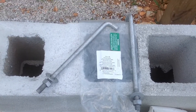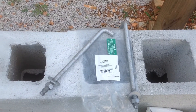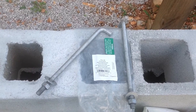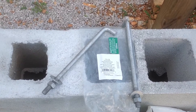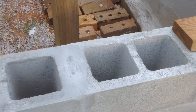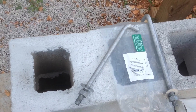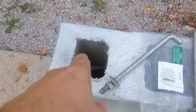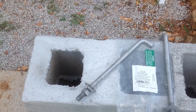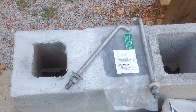We're going to show you how to install anchor bolts. An anchor bolt is what holds the house — the wooden structure — to the concrete foundation. They can be put inside concrete walls or inside concrete blocks, which is what we're doing here. The center of the hole is hollowed out, so we'll be putting concrete inside and placing the anchor bolt down inside. Once the concrete solidifies, you've got a firm bolt to anchor down your home.